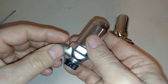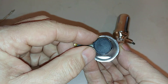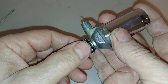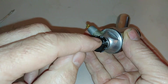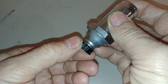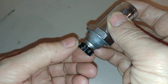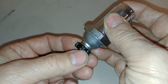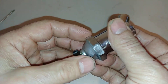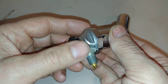Occasionally I run into these on the surplus market, and we 3D print an adapter over the adjuster wheel with numbers on it so you can get a better idea of the venting position and use it to help balance the system. Of course, this means it should be accessible — just threading these on and then putting a radiator cover over it really doesn't help.